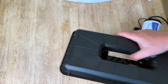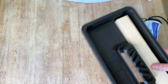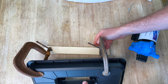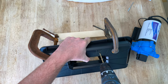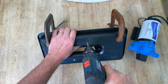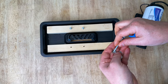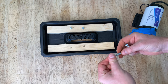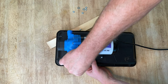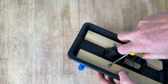Flip the shelf back over and add the scrap wood. Make sure it covers the locations that you have marked. Clamp that wood to the shelf. Drill holes through the shelf and scrap wood. Put washers on your screws and push them through the wooden shelf into the bottom of the pump's feet. Use a washer on the other side along with your nut. Hand-tighten the screw, and make sure you do not compress the rubber feet of the pump.